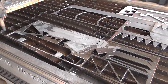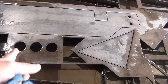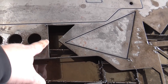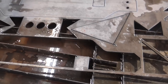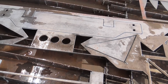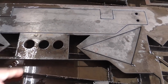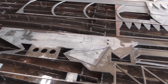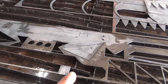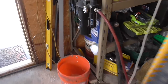Let's talk about firing reliability here as I'm picking those parts out. You can see there are three holes — it's supposed to be an outline cut around like this. This is a bracket for holding straps or chains to secure the cargo. Apparently wherever it had to fire, it didn't fire, so it didn't cut that outline. There can be several issues — worn consumables, but the consumables are fine. It's only one misfire, not a whole bunch.